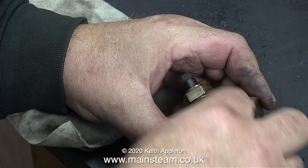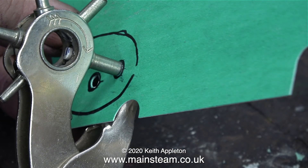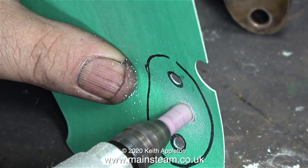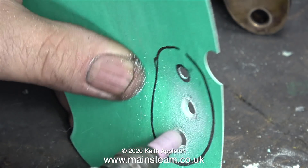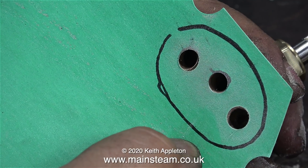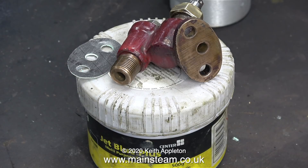As I showed earlier in the video it looks like there's a gasket already fitted, but just in case it doesn't work properly I think it's a good idea to make another one. I drew around the fitting, then estimated by eye the position of the middle hole which is offset. Then I punched out the holes using a hole punch. The holes weren't big enough, so using my Proxxon motor tool fitted with a grinder I enlarged the holes — going halfway through from one side, then turning the gasket over and continuing from the other side. That way the holes were much cleaner; going all the way through from one side left the hole a bit ragged. The result was a very neat gasket that was a perfect fit. I'm not going to fit this gasket straight away — I'll use a modern equivalent of boss white jointing compound first and see whether it seals.